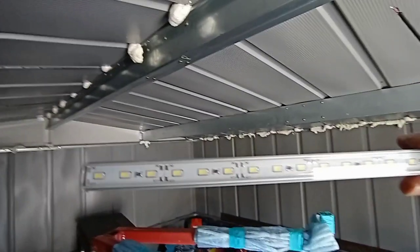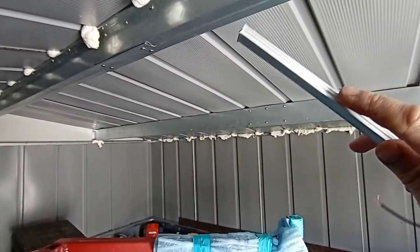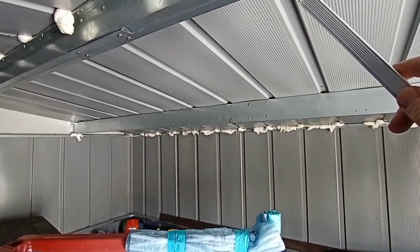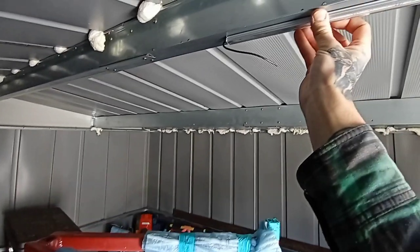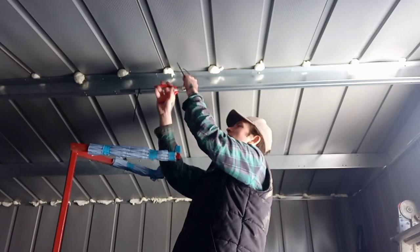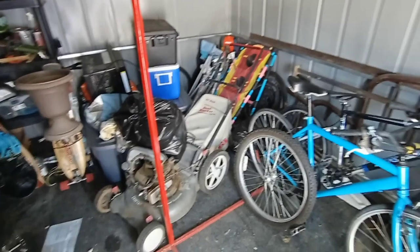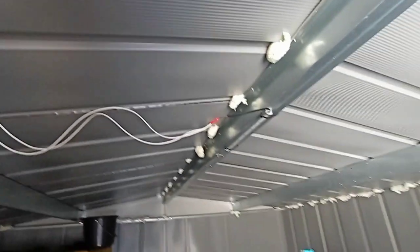So I'm thinking with these lights it shouldn't be any different. These LED strips are fully encapsulated and come with clip-on mounts, but when I tested it they need a pretty shallow bolt, and all I have are self-tappers that won't really work. So instead I got these holes and I'm just going to zip tie them up — that way if I need to move them I can. I'll get these mounted up first, then start wiring. Skipping ahead, I've zip tied up my lights.